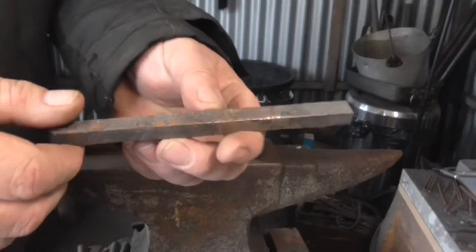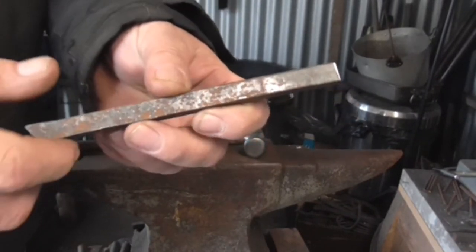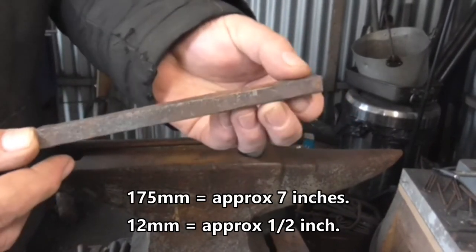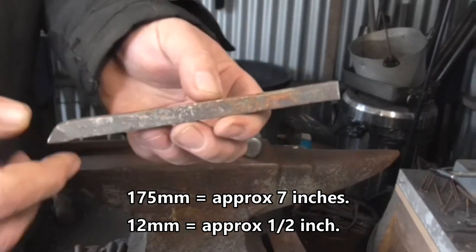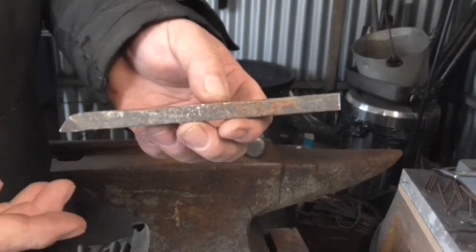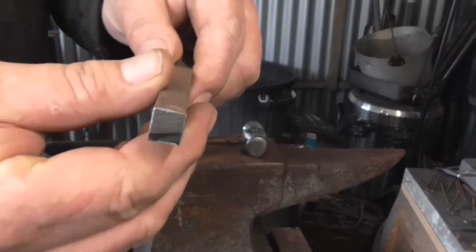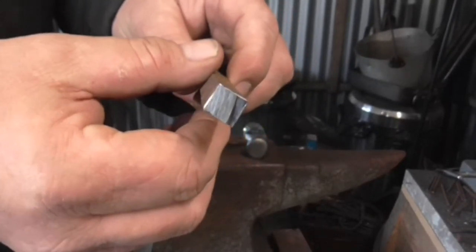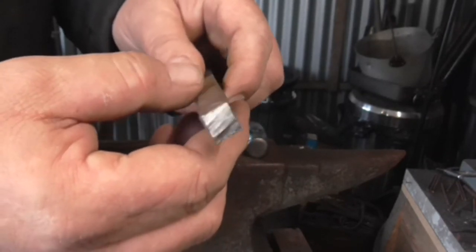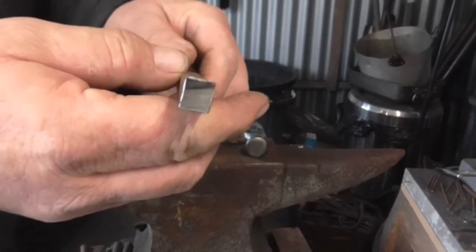I'm going to attempt to make a pin tool for the hinge I made in a previous video. At my lesson this week I was shown how to do this. This is 175mm of 12mm square mild steel — the length is really irrelevant to this exercise, just a random length I had lying about. The first job is to change this from a square profile to a round one, taking the edges and both corners to make it into an octagon, and then make it round.